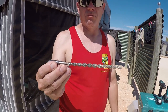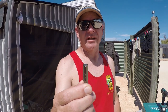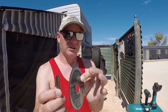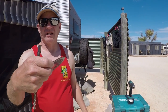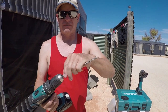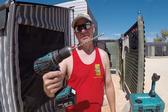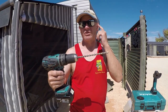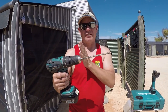My pegs are eight mil diameter. I've bought this — it's a rotary hammer bit, and it doesn't necessarily fit straight in the drill. It had an inner piece on it which didn't work in my three-jaw drill chuck, so I had to cut it off. I've used a cutting disc — I carry my Makita angle grinder with me, it's really handy — that just cuts through it like butter. I've also got my hammer drill. Now that I've cut the inner bits and ridge bits off, it'll fit into it and lock into place. It's a sufficient length to get the peg in. The reason I bought a rotary hammer bit was that straight masonry bits with enough length were two or three times the price, so I just bought this one, cut the end off, and that'll suffice.